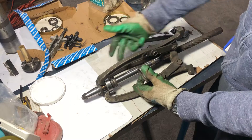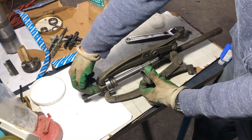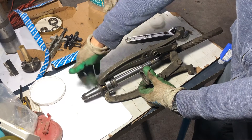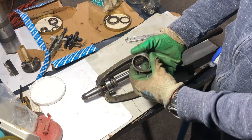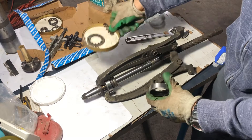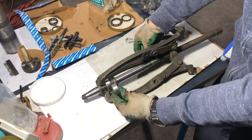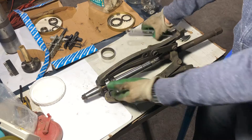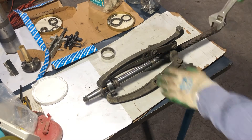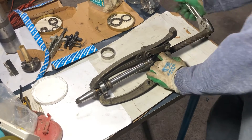In this way you can pull it and take everything out, otherwise it is not possible because the shaft has this part here that will not allow you to push the center — only the upper side. So the only way I could think of was to take all the balls out and then reinstall the bearing this way, so I can pull the bearing out. It needs a lot of power but it is coming out.